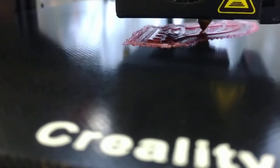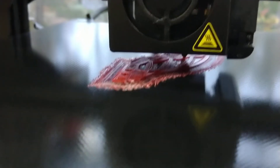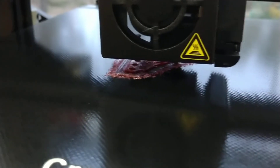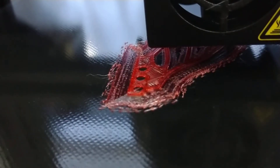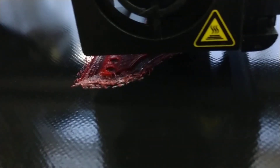This is a really slow and painful process, but it is laying down the law now — I'm getting a good fat print on this glass. You can see where I printed the skirt, I had to baby-step the Z up. It started out really bad, but right before I started printing I got the temperature and speed right, so we'll see what happens.